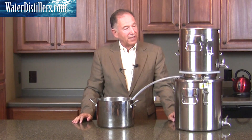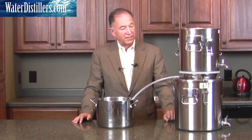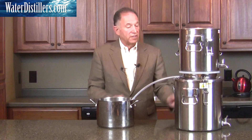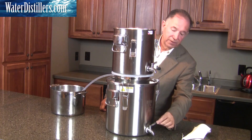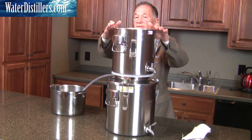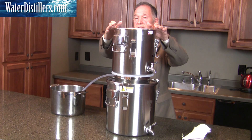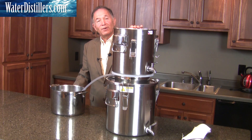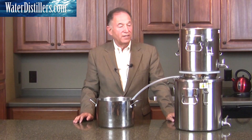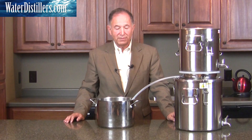Now let's say the water down here has gotten pretty hot because the fire has been on for a long time. Instead of opening up the system and taking everything apart, that's what this drain faucet is for. You just open this up to empty it out a bit, then refresh it with the water you have available and start the cycle all over again. The beauty of it is that you don't have to disassemble it, and that's what you're going to find really beneficial — giving you higher water production. You should easily get 16 to 18 gallons per day, and it'll actually take less effort on your part because you're not having to disassemble and reassemble things.